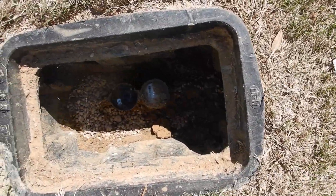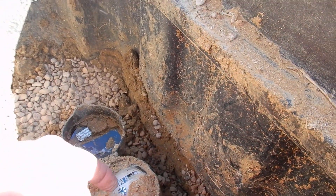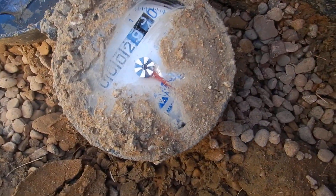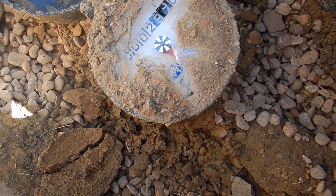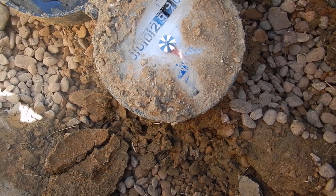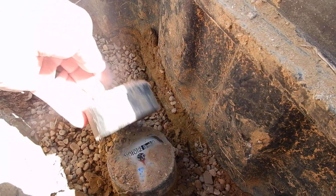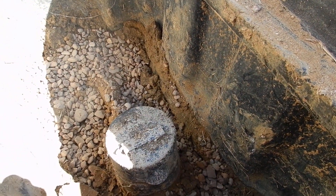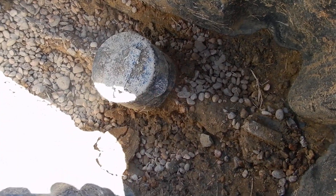This is the water meter, it's in the yard near the parkway sidewalk. Right here in the middle of this dial is a flow indicator — some people call it a cheater wheel or cheater paddle. It's very sensitive and if water is running, it's spinning. That's potable water supply. This valve belongs to the municipality — the city. This doesn't belong to you. Parallel is on, perpendicular is off.